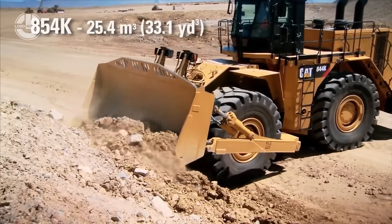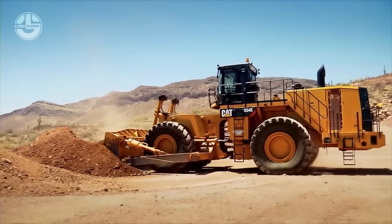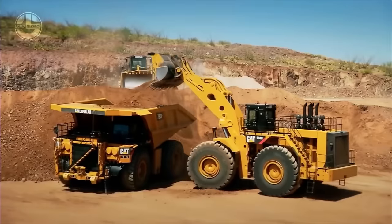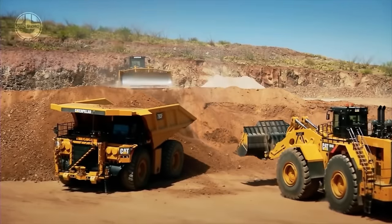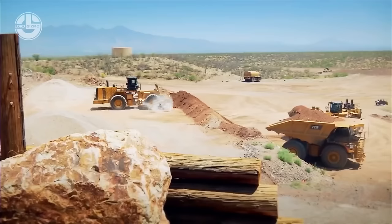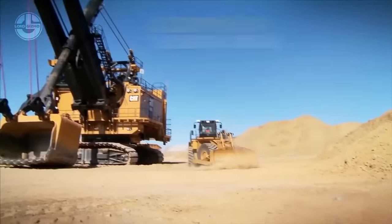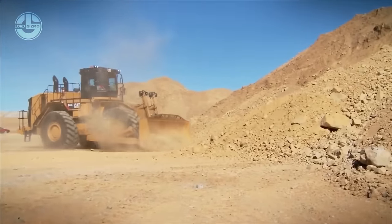To maintain efficient load management for various material kinds, three distinct blades have been developed for this beast, which include a coal blade, a semi-U blade, and a heavy-duty semi-U blade. Moreover, the machine incorporates a steering system and drive, an impeller clutch torque converter and rim pull control, and an electro-hydro control. All of these contribute to its agility and responsiveness at work. This results in exceptional performance, less fuel consumption, and low maintenance.